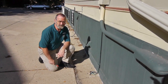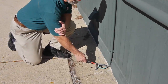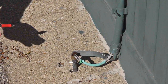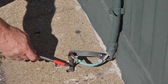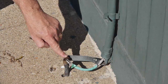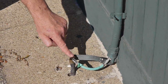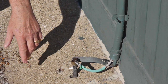Here's the second most popular electrical ground found throughout the United States. It's called a driven ground rod. This driven ground rod, as you can see, is about two inches above the surface of the concrete. It's supposed to be left flush to the concrete, but the code official needs to examine that it's present, so electrical contractors leave it a couple inches above the ground to confirm its presence. The purpose of this ground is exactly the same as the ground attached to the cold water main — it takes any high voltage and carries it through this bonding strip into the copper ground rod, where it is sent into the earth and the electricity dissipates.